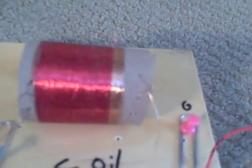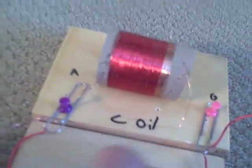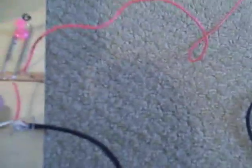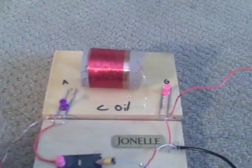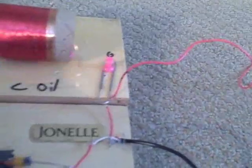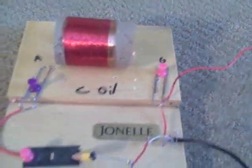After you have that, you can trim off the excess toilet paper tube, then take whatever you're mounting it on — I have it on a wooden box — and use thumbtacks into the wood to hold it in place. Next, take two of your paper clips and twist the ends. Before you attach the wire, note that it has an enamel coating on it. Take a small piece of sandpaper and sand it off. On the red wire you can see it come off, but on the copper wire you have to sand it a lot more until you think it's all the way off.